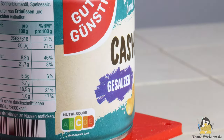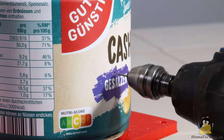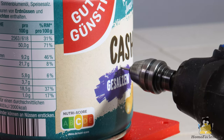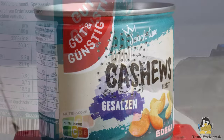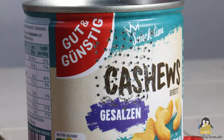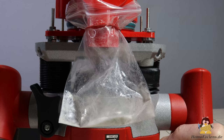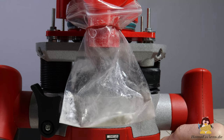In addition to grinding, heat is also generated by friction between the rotor and the ground material. The dust-like particles in particular dampen the grinding process and generate high frictional heat. To remove the dust from the inside, there is a sieve on the wall. This consists of 1mm holes made with a drill. Since those dust particles are the desired end product, these are directed to a plastic bag. The whole system is dust proof, at least in principle — the proof of concept prototype still has a few gaps through which dust can escape.